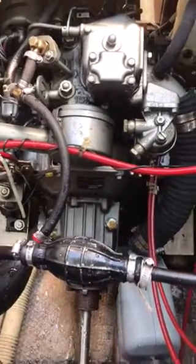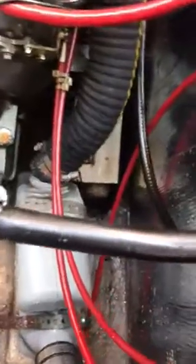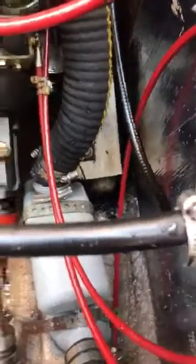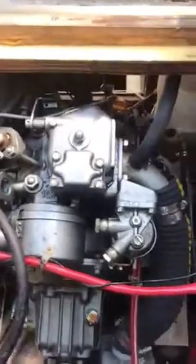What happened is, this line coming in, ignore this bulb here, I'll talk about that later. This line right here got completely clogged up with sediment that had been sitting in the tank for probably years and years and years, and therefore the pump right there could not get any fuel to send on its merry way down to the engine and down to the diesel separator, and I'll talk about that shortly.